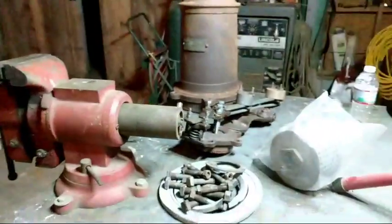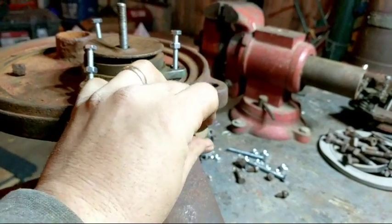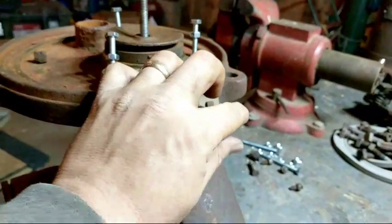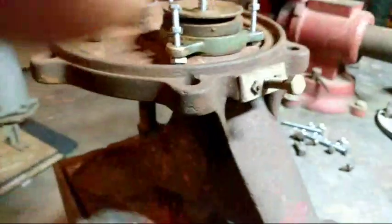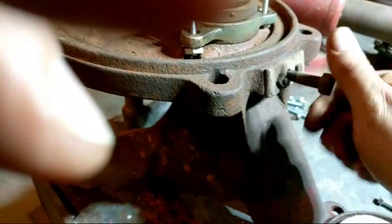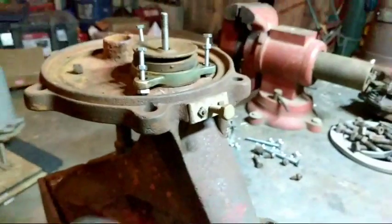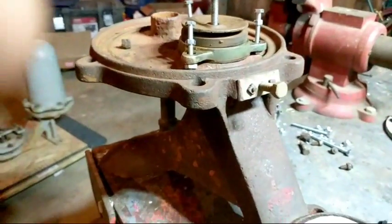If you let this chamber get full of water and no air inside, there's nothing to compress, and it starts to break itself. It'll tear itself up because, right? Everybody knows water's not compressible, but air is compressible. I hope everybody knows that. And that's why the snifter is so important.